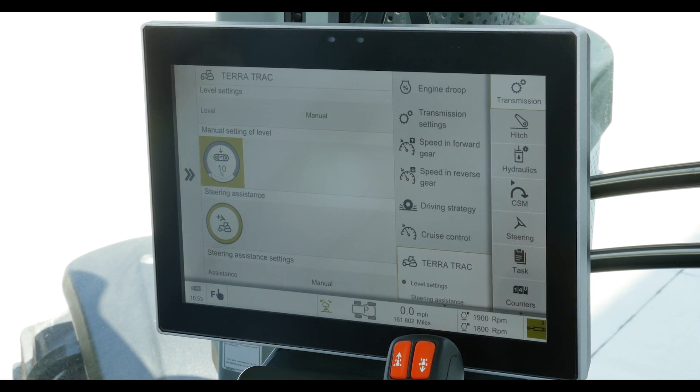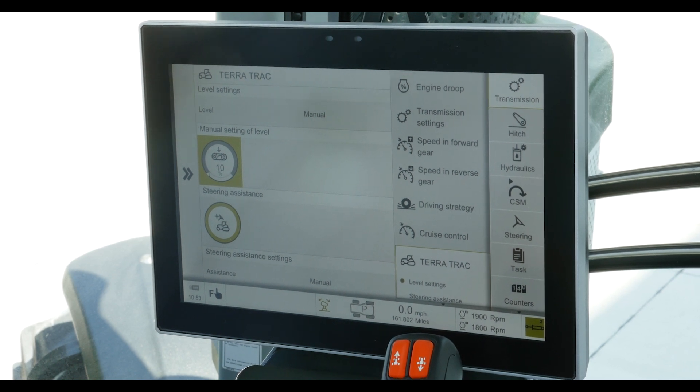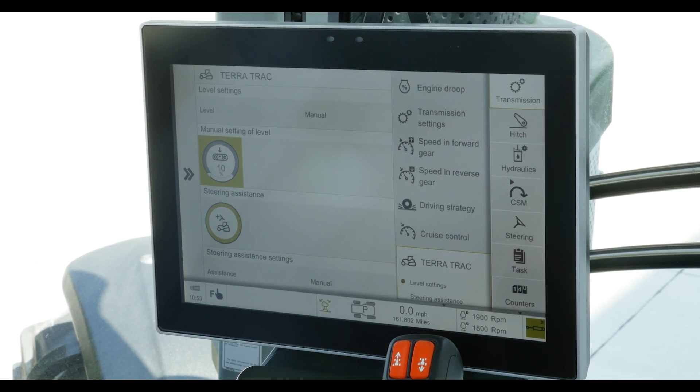You can also use it if you need to force a higher ground clearance to work over bedded crops. You can also use it for finding or pulling level on the drawbar. All implements pretty much need to pull at a level attitude forward to rearward, and by having the ability to adjust the track height, we can maintain that levelness for maximum pull in the most efficient and productive settings.